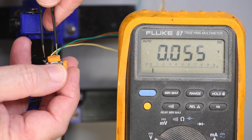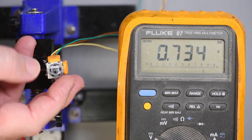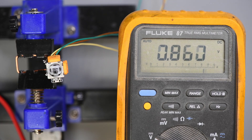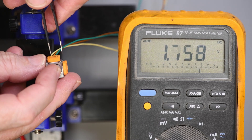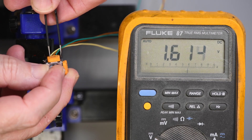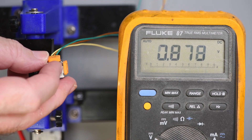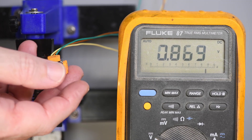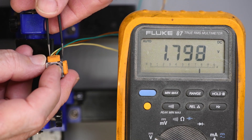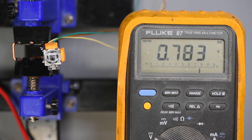You pull the joystick to one side and then insert a small pin into the hole on the same side. The pin will stop the magnet part from turning. Then apply a little pressure to the joystick, pushing it back toward center. There is quite a bit of spring in the plastic connecting arms and shaft, so it's very hard to move it a small amount. Most of the time it doesn't move, or with a little extra pressure it makes a small click sound and moves too far. It seems to be a process of going in one direction, then going back in the other direction, and repeating till happy with the results. With a bit of patience, it can get pretty close.